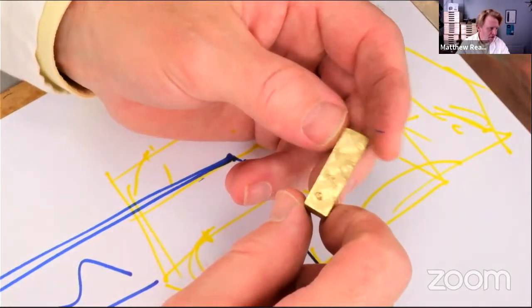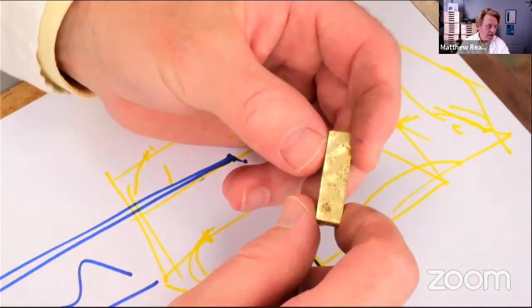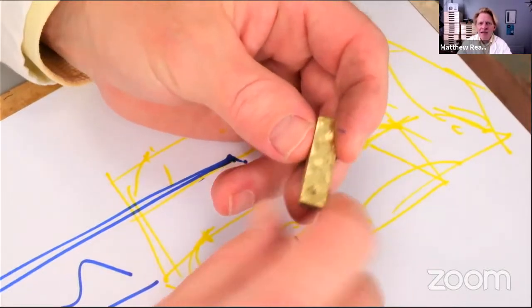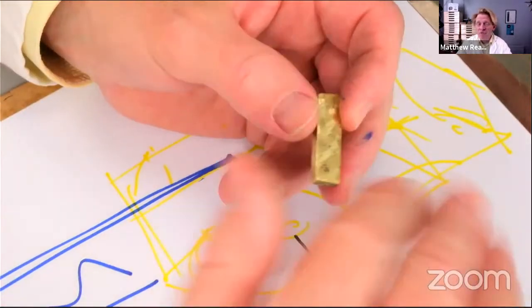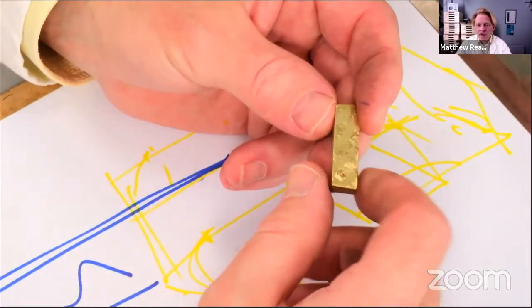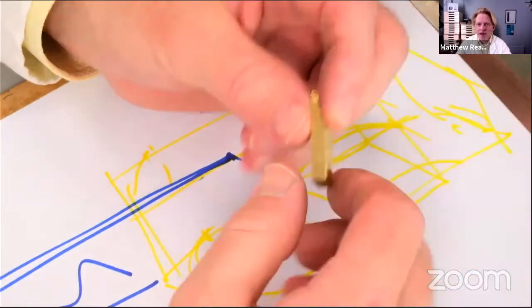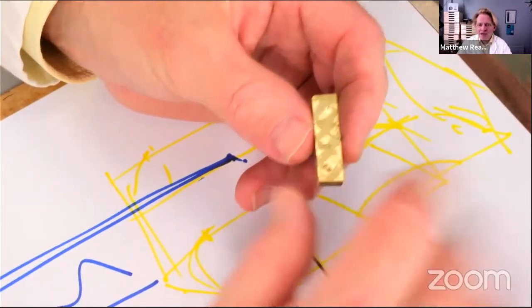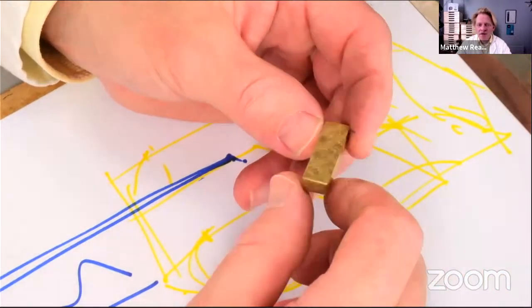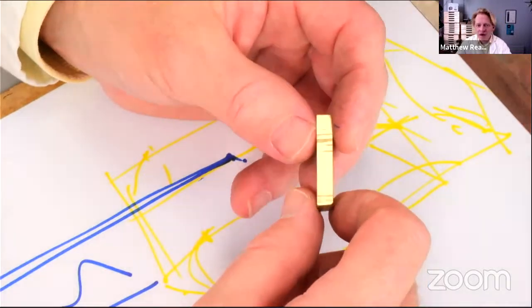Are you leaving the rust on the escape wheel, Arba? No, I'm going to... oh, hi, Vicky, as well. No, I'm going to do some more cleaning. I just did some preliminary cleaning, but I'll get some of that off with some more steel wool and a bit of microcrystalline wax on there. I'm certainly not going to try and refinish it, but yeah, I'll stabilize that rust. It's just that was a preliminary washing just to get this off the starting line. Derek, so yes and no.